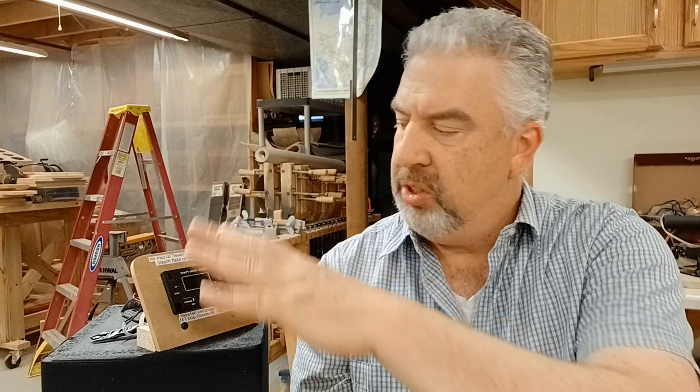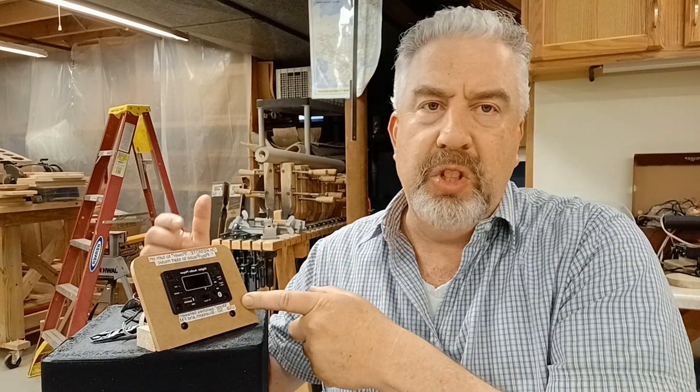So that's my plan — I'm going to redo this thing and tear this out. It worked, and thank God it got me through the day, but this thing's junk. Don't buy it. I've been able to duplicate the issue, and at this point I think it's most likely due to vibrations from the sound output jiggling something inside the board, causing it to cut out on punchier bass notes — it happened worse when louder rather than quieter. Basically just bad build quality. Whatever the reason, I'm done with this thing — I'm not taking a chance on it anymore. I also think I can make the speaker sound better with the new setup.